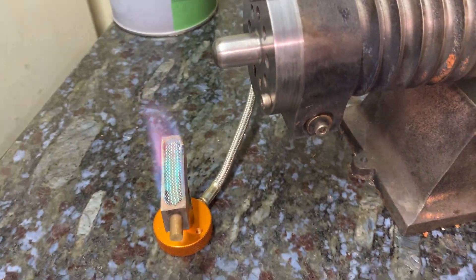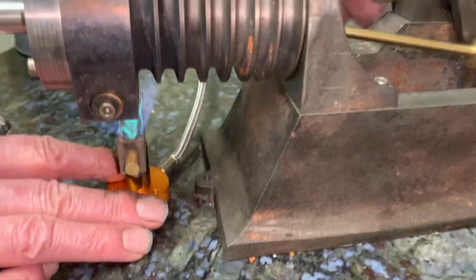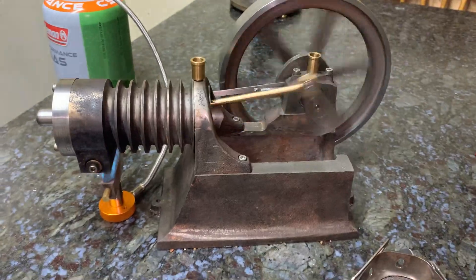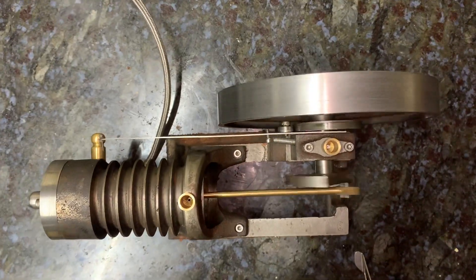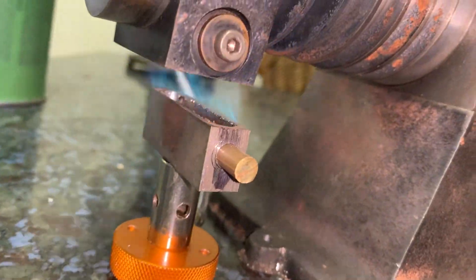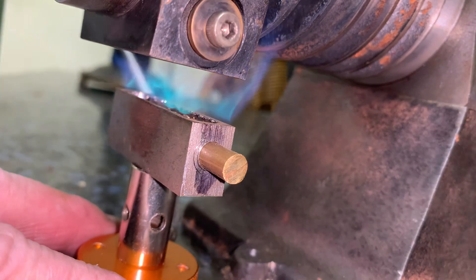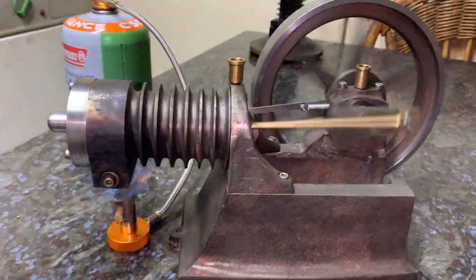Which is a nice clean flame, hot, and seems to work reasonably well. As you can see the flame is reasonably concentrated around the port, and then by a chance of positioning it does have a tendency to blow the flame out if you pull it too far forward.